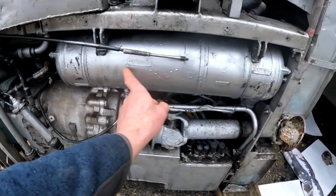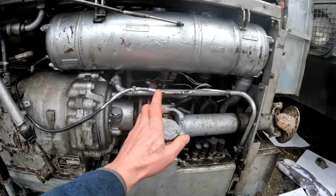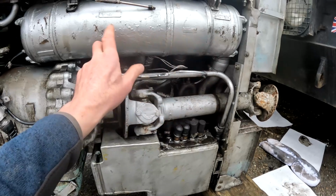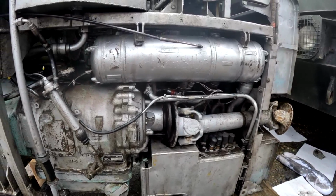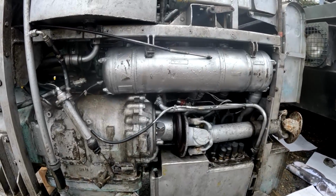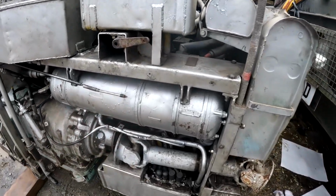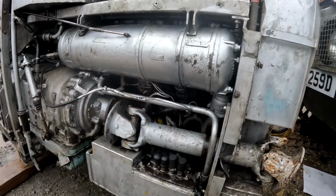This piece right here is actually the heat exchanger, and it works very similar to a boat heat exchanger in that you've got different compartments with different oils. So we've got the engine oil, the fan oil and the transmission oil all coming into different sections, and then water is pumped through the whole thing, through loads of little tubes in the centre. It's an absolute nightmare to take off and work on. It's very poorly designed, I think. It's not the best. But they didn't have a lot of room to play with, so they've had to fit it in. Whoever designed this clearly didn't like the people who were going to work on them and who had to fix them, because that is an absolute nightmare to take off, and you've got to realign all these different pipes. Some of them are actually hard piped, so there's not a lot of flexibility. Absolute nightmare to work on and take off.